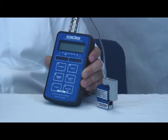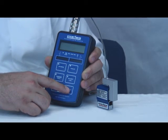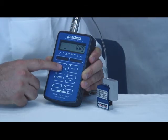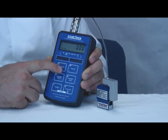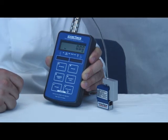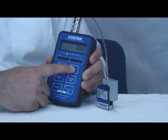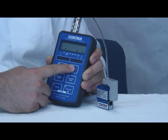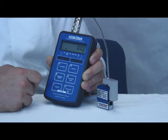I'd like to briefly explain the functions of the buttons on the 9320. First, the power button — pressing and holding turns the power on and off. Starting at the top, there's a range button, which allows you to use two different ranges with the 9320; pressing it changes the range. You can calibrate two different ranges — the second range can be used for a second load cell or for different units like kilograms. The hold button display-holds the reading, useful if you're adjusting equipment and need to lock a reading until you press the button again. The gross net button is used for zeroing or taring and it's recoverable, so you can tare and then un-tare by pressing the button again.